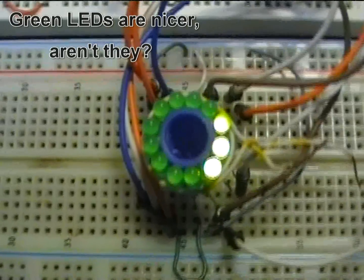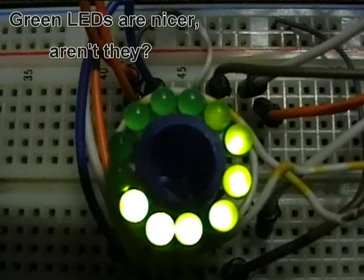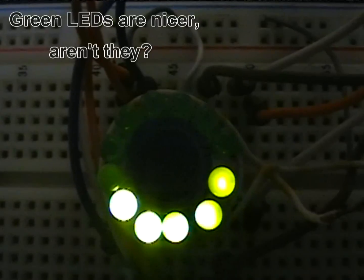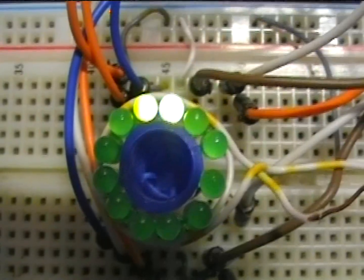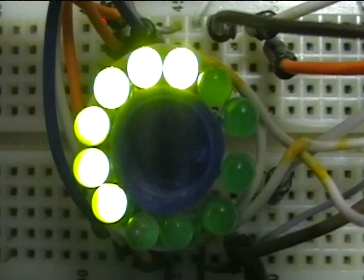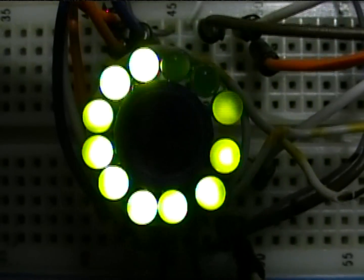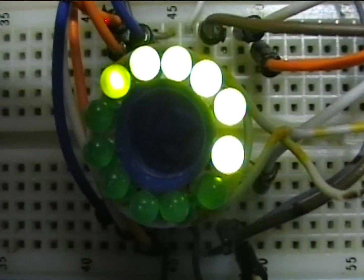Along with a short assembly listing, the software PWM runs easily at 1.1 kHz frequency for the 12 individual channels simultaneously with 255 duty cycle steps. This frequency is ideal for controlling LEDs, and with 255 steps, the fade-out effect is very smooth.